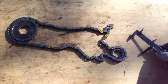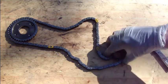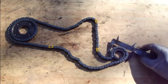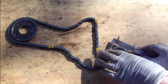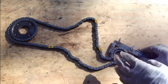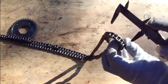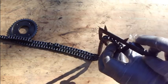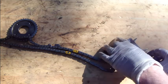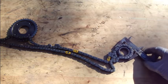This smaller size means that the belt becomes loose. This diameter — or actually this length from here to here — must be at least 5.2 cm. Now I measure that here. I insert that measurement in just this central area and measure this length. This amount must be more than 5.2 cm.